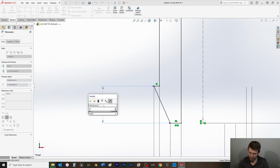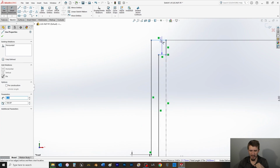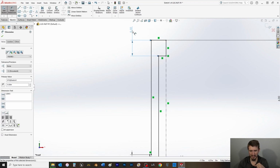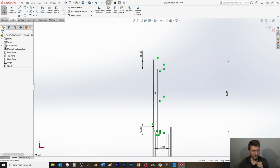And we'll make this height. Yeah, why not? Top of cavity. Now this we have more freedom with, so we'll make it a 1/2 inch. Alright, looks good. Looks like something. So then what we can do here, now again, this is a long lug nut intentionally. We're kind of making this one of those almost spiked lug nuts for humor. And there's a slight taper. We'll not do that in the drawing though. Draw it at 90s and we'll tune that later.